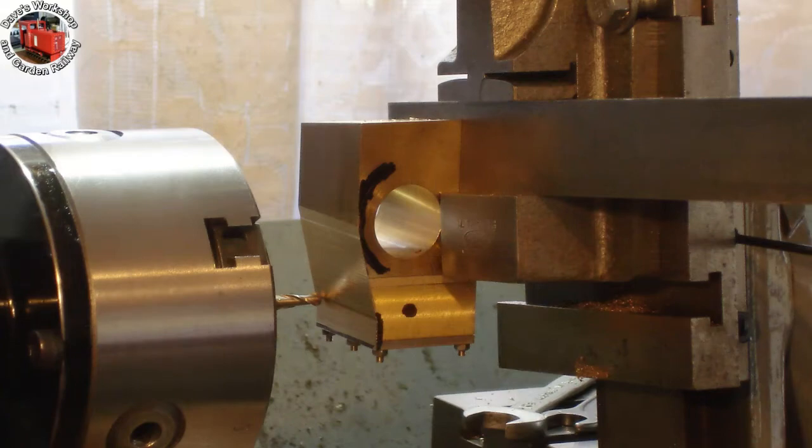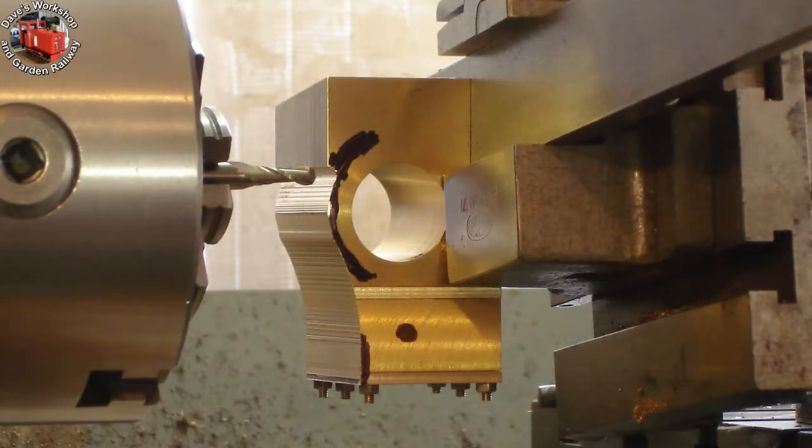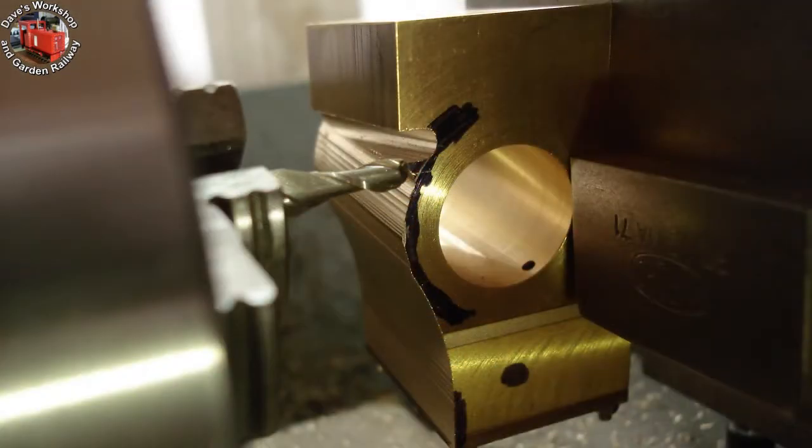I won't be doing this for the second cylinder, but I was just making it up as I went along. The large radius was generated mathematically in 20 thou — half a mil — vertical increments. The small radius around the bore was also generated mathematically. The vertical slide has been swiveled eight degrees as the radius needs to progress further on the front face of the cylinder.